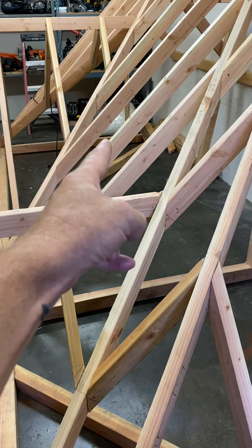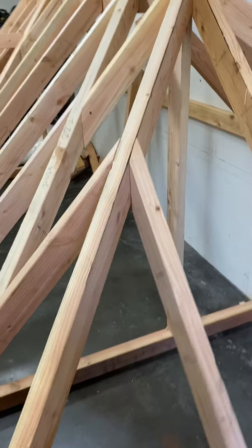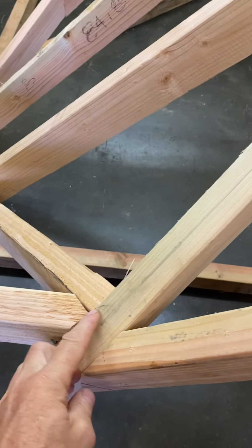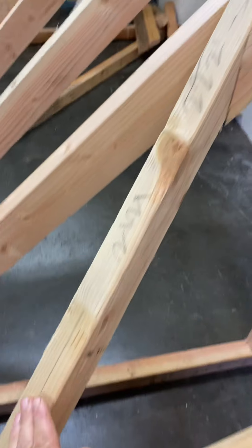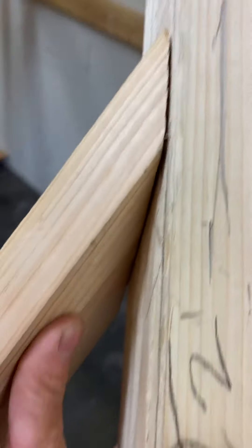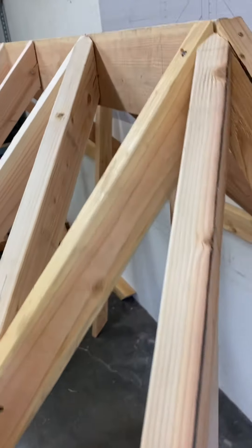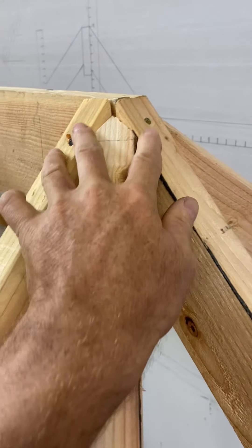We have to go all the way over to a common way over there, and there may not even be one in this roof. So they do this — where it stacks at the top it's a valley, so it stacks to center line, which means this side of it as it passes the ridge here, this side of it is too high. Everything — all the jacks — planes to the center line, so you'll see this jack here is stacked low. Those two lines are there to show you where the backing begins, and then starting here running all the way up to the top, it has to be backed from the center line over so it'll plane in with the rest of the roof on the other side, whereas the hip — the sides plane in with the commons and it's fine.